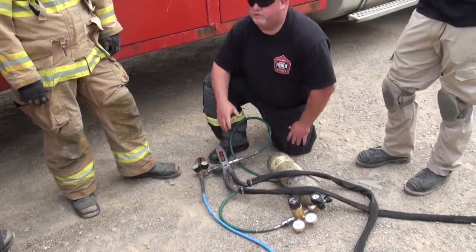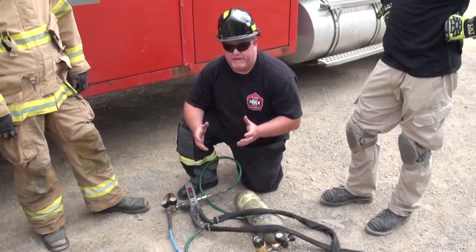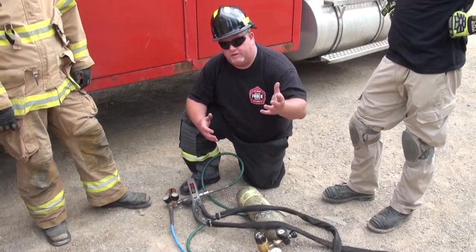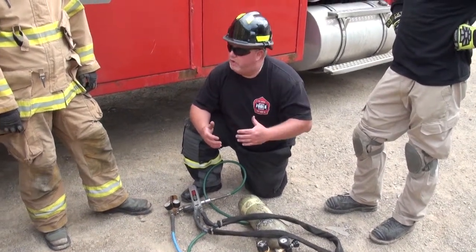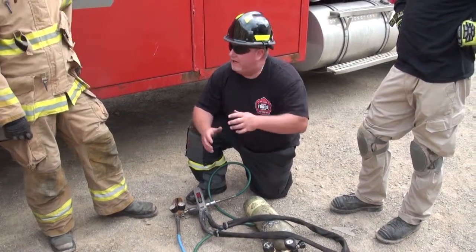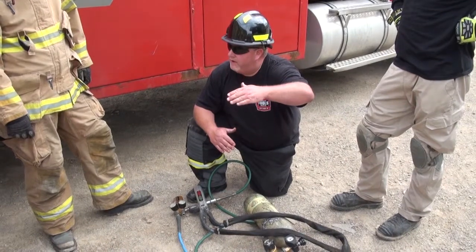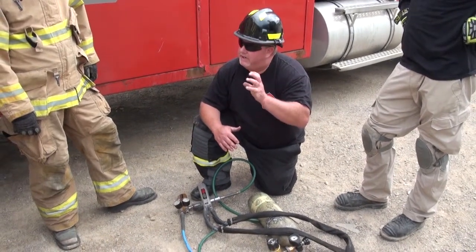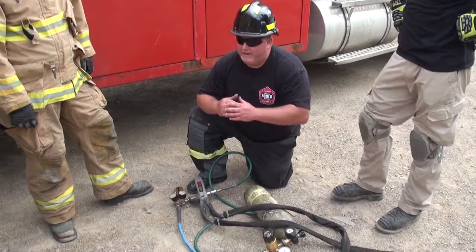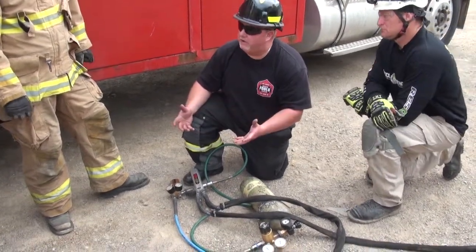The green button charges the system and basically loads the strut. If you're using the medium strut or lower, 2 bar — about 30 PSI — is plenty of air. That's enough pressure to extend the strut and follow your load automatically, because the mechanical mechanism is what locks it, not the air. The air is just going to shove it up for you like you were standing there, and you won't have to be anywhere near it.